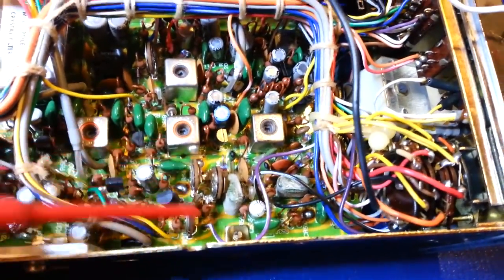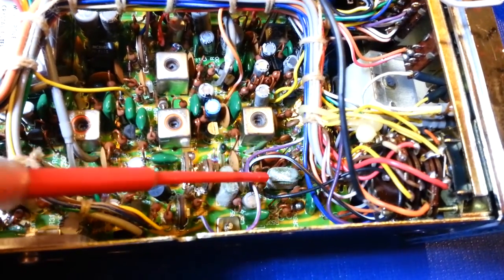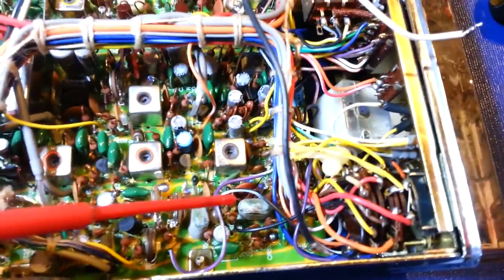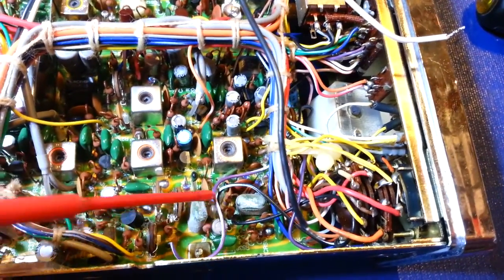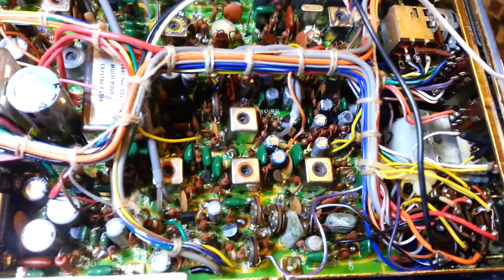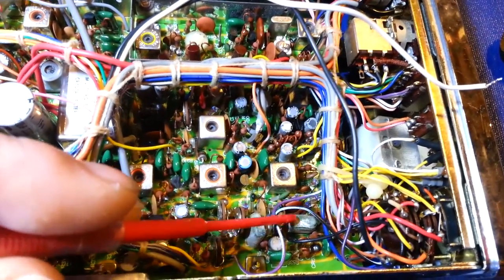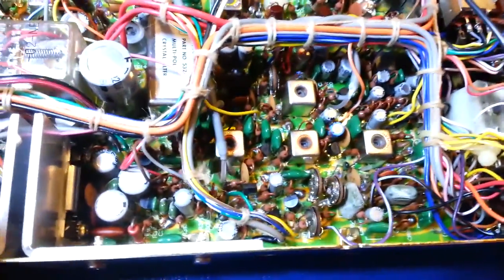One of my questions is: what is happening? Was it a problem with the epoxy — the resin, the hardener — when these things were manufactured? I'm not a chemical engineer so I don't understand the decomposition process of epoxy, but what would cause this breakdown where it just turns to dust? I assume what's happening is it's shrinking, which is why they're cracking open. The shell just cracks apart like a nut, the capacitor becomes completely exposed, and then something inside crystallizes and outgasses, forming that white residue.